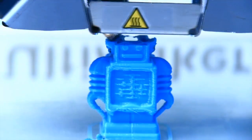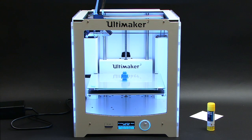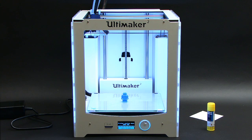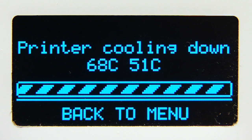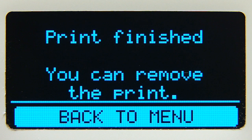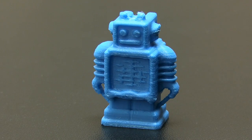Quite amazingly, it just appears before your eyes. And there we are — our first print on this printer has finished. The little robot is standing there, all printed out. Now you do have to be careful not to grab it off the build plate straight away — the plastic will still be very hot, and the build plate will still be hot. You have to wait for the printer to cool down. When it tells you it is cool, we can go in and hopefully just snap our robot off the build plate. And there's our first print off the Ultimaker 2 — the Ultimaker 2 robot.